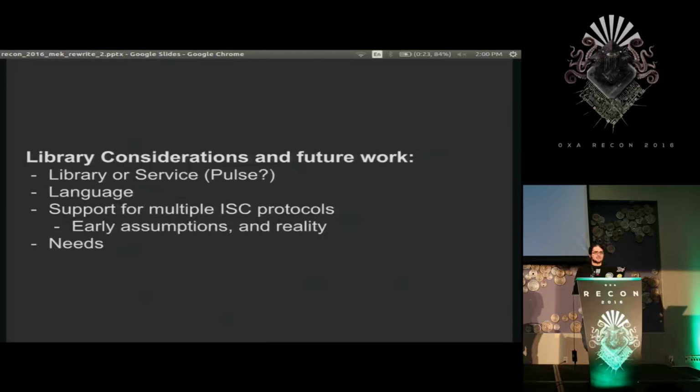And because these controllers are actually able to support more than just JTAG, which I probably should have mentioned earlier, that's why I call them in-system configuration controllers, because it works with JTAG and SPI and I2C and all these different things. We should have an interface that can grab these devices and present all the features they have, and you can grab the JTAG interface or the SPI interface, and it would just work.